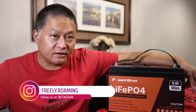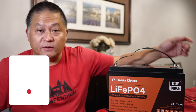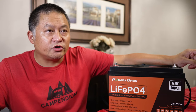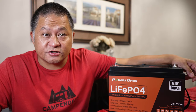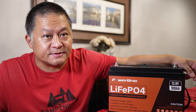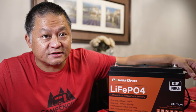I've shown you guys a lot of power stations and 100 amp hour batteries on this channel over the last year or so. While they're both great at keeping your power going in the wild, being able to inexpensively extend the capacity of a power station can get a little bit expensive. You can just charge your power station when you drive, however you have to drive a lot if your daily consumption is on the high side. If you're charging your power station with a cigarette lighter socket, by default it can only charge at up to 120 watts — that's because vehicle power is 12 volts and the socket capability is limited at 10 amps. So 12 volts times 10 amps equals 120 watts, and anything higher than that is pushing the capacity of a cigarette lighter socket.